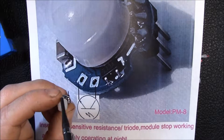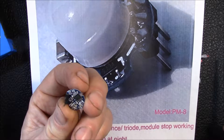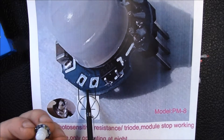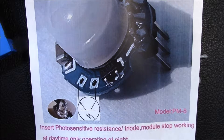There are larger modules that have adjustable pots on board so you can set the delay time and sensitivity. This one has no adjustable features on board, but there are these two pins right here — you can see them in this big picture — where you can install a photosensitive diode or LDR, a light dependent resistor.